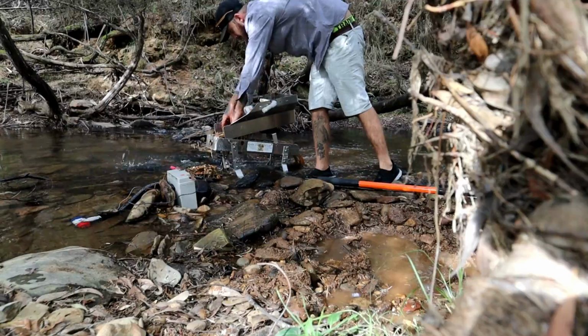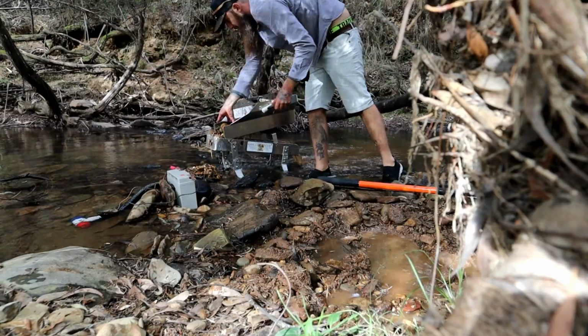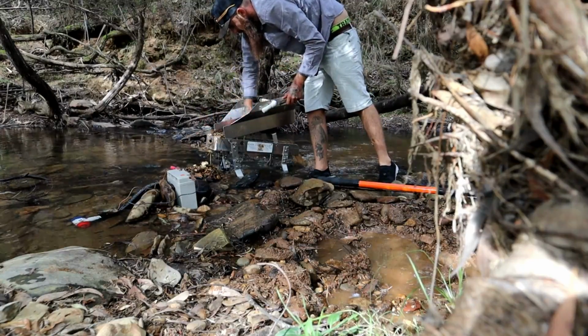And often this means that I will utilize a river sluice. Now river sluices are fantastic. I will never ever be without one. However, river sluices inherently create extra work for you. First, you have to find a spot that the river sluice can operate in, and that could be some distance away from the area that you're taking your dirt. Second, a lot of river sluices require classification of their material before you can run it down so it efficiently catches the gold, and therefore you've got to bring in buckets and you've got to put in more manual labor to just collect your dirt.